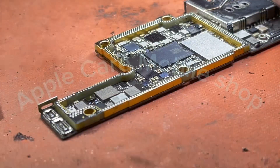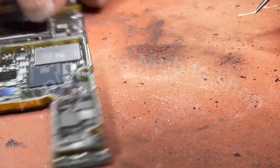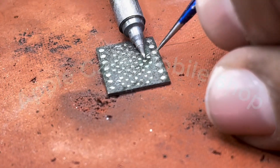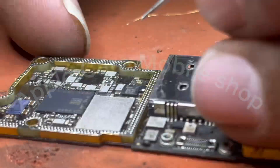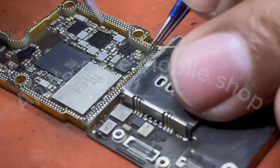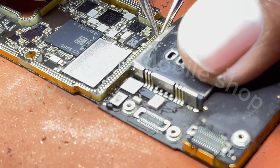We will connect the connection which is not showing on the connector with the help of a jumper wire. The connection we do not see on the connector — we will check from the top surface of the board to see if the reason for the non-connection is in the upper layer or it is not connected to the IC itself.